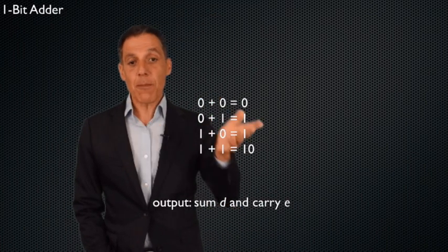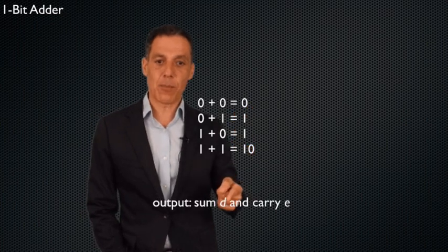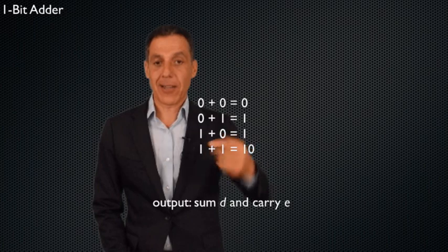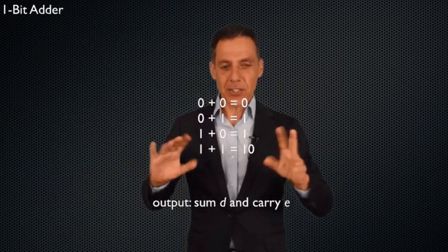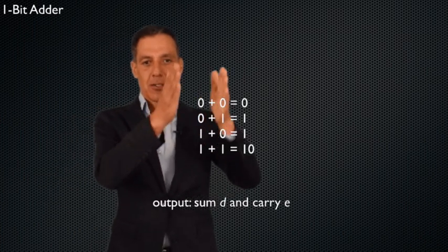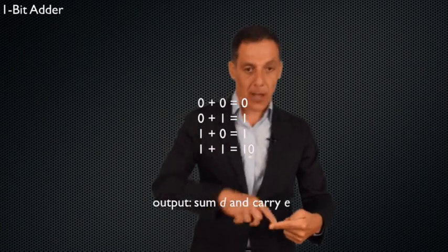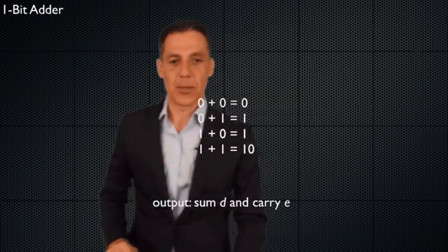So let's think about binary addition in terms of now having three inputs: A, B, and a possible carry. That's going to allow us to generalize the circuit down the line. The output has to have more than just a sum — it has an output which is what comes below the line, but also a carry-out. So even this one-bit addition has gotten a little complicated: two inputs plus a carry-in, that's three in, and the output is the sum and the carry-out — two outputs.